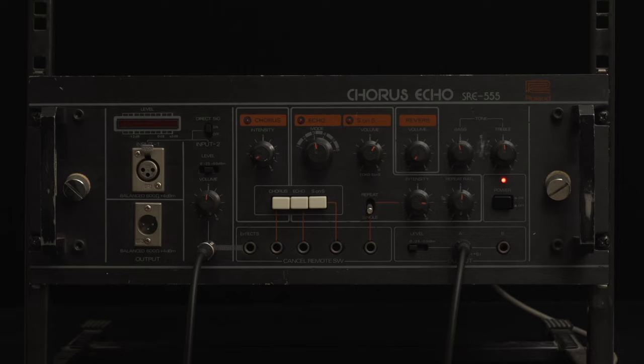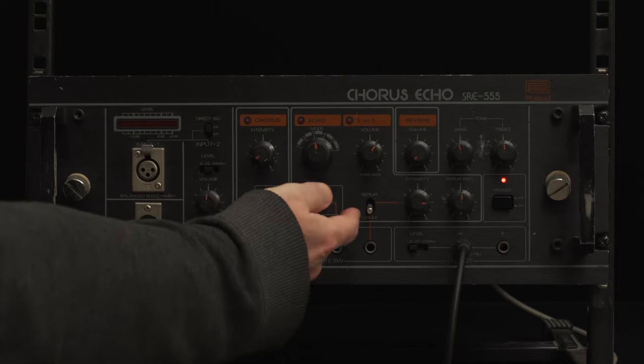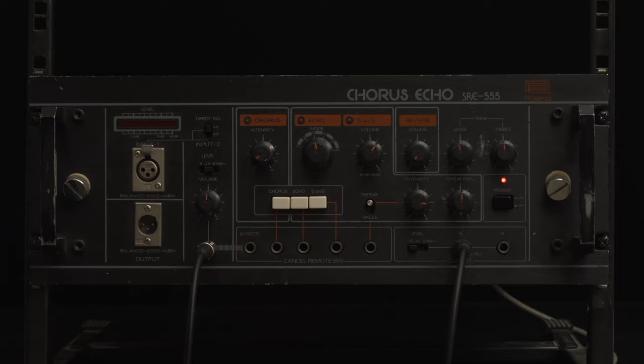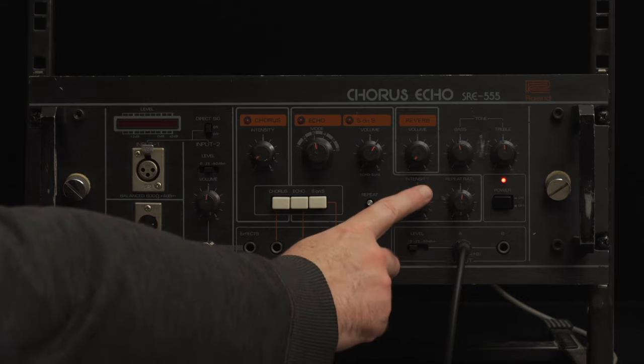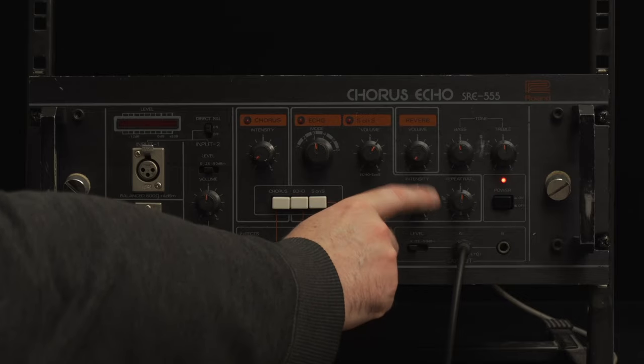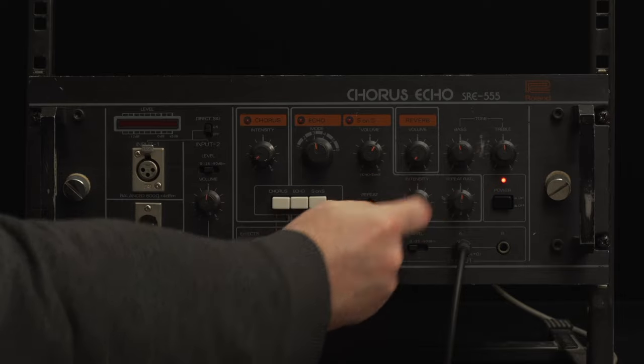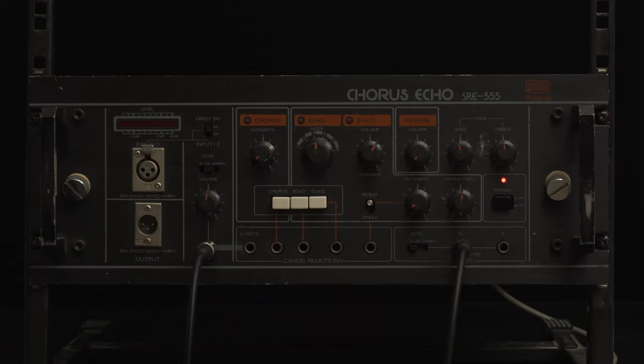As mentioned earlier, you have the repeat or single switch, which allows the echo or sound on sound effect to repeat continuously, as opposed to just once when set to single. And repeat works in conjunction with the intensity, aka feedback dial, but the single switch will override the intensity value. So be careful flicking back from single to repeat. Maybe check where your intensity dial is before switching so you don't get an earful of feedback.